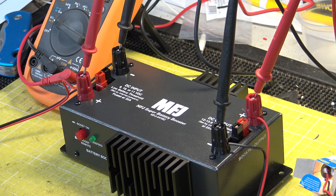One dilemma is that we can't always take a generator — we can't pull into a lay-by, get the van out, start up a noisy generator, then put the mast up and put the Antron 99 on. You can't always do that. So for the walkie talkie test, we're simply going to have either a permanent mount or a mag mount, and plonk on a nine-foot full quarter-wave as a test aerial. That makes it much fairer rather than using something super-dooper.